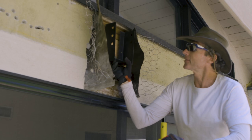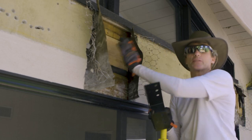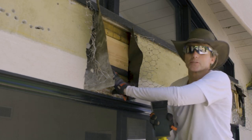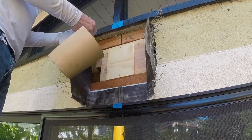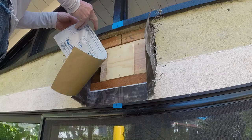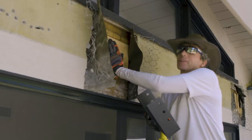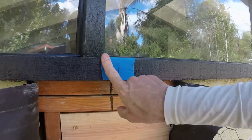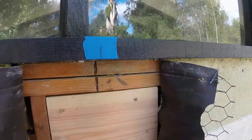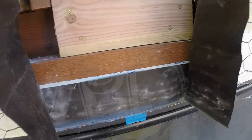Before I put these hangers on, I'll need to put the flashing back, and then I have some of the window flashing that I'll put around that is kind of rubbery, so any screws that go through this should seal around the rubber. So let me get working on the flashing here and get these hangers attached. I added some painter's tape and remarked the center lines for the beams since the first marks would be covered up with flashing.